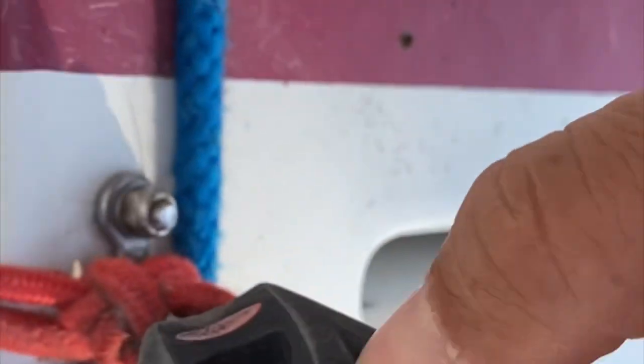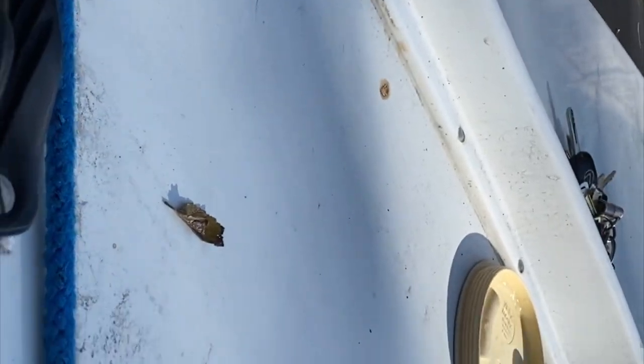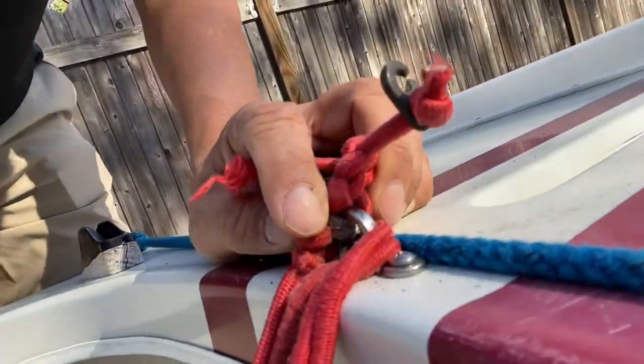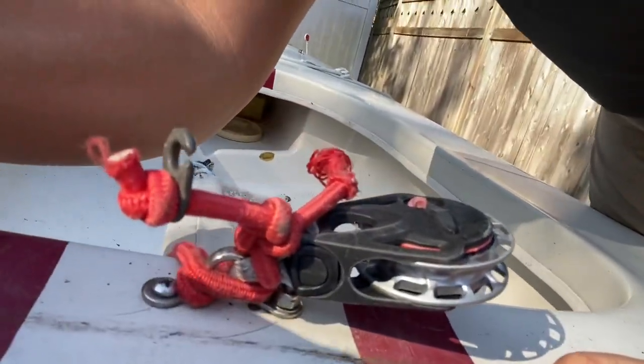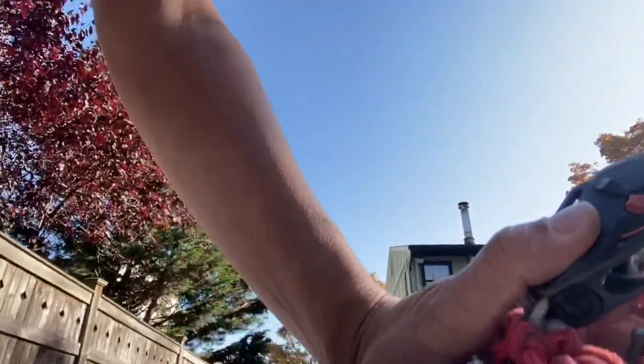That's the inside. Here's how to attach a D-strap — this is underneath the lip. You can put a backing plate or a couple of big washers underneath here, and that'll hold the D-strap. This one has a round ratchet block, and the previous owner put these cleats in here so you can put the mainsheet in there when you don't want to trim. To put a block on, you fit the D-strap through the lip here, put bolts through the holes in the fiberglass, and that secures it.